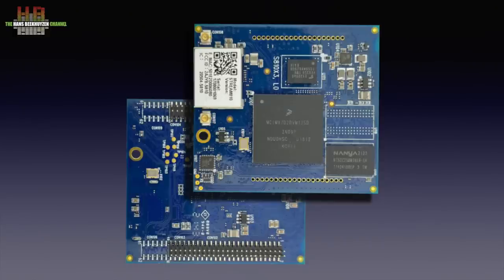Lindemann uses the same streaming engine used in the Limetree series: the Stream 810 Streaming Module by Stream Unlimited — a company founded by ex-Philips people over 15 years ago in Vienna offering universal streaming solutions. The output of the Streaming Module is in I2S format, with data and clock signals over separate lines. That is connected to the Asahi Kasei Microdevices AK4137 resampler, which can be used in two modes: PCM or DSD.